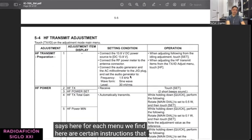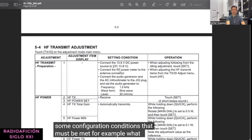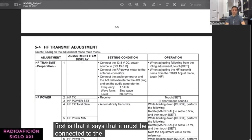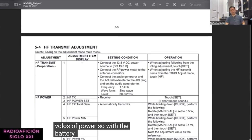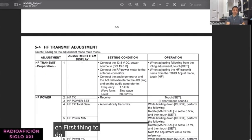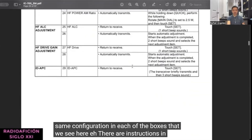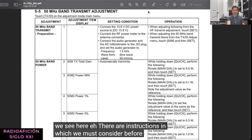The modifications would have to be adjusted according to what the service manual says. For each menu we find certain instructions - for example, here to adjust transmission in HF there are some configuration conditions that must be met, such as that it must be connected to 13.8 volts of power rather than a battery. Each menu has specific conditions that must be met before making any modification to the radio.